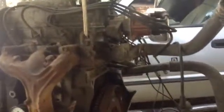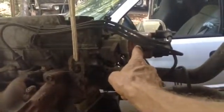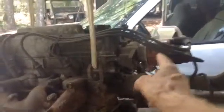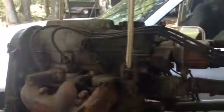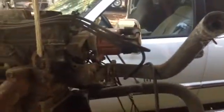So what we have to do is figure out how to take the signal from this distributor — from the sensor inside this distributor, they call it a camshaft position sensor. As you can see, the shaft of this distributor is straight in line with the camshaft, which is here in the head. There's the valve cover; the head has the exhaust manifold on one side, intake manifold on the other, valves in there. That cam spins around in there, and this sensor inside here is the camshaft position sensor.